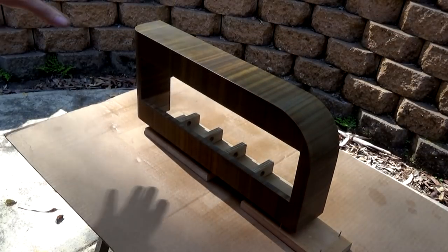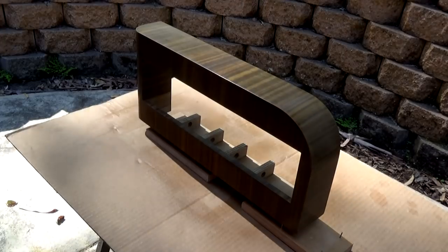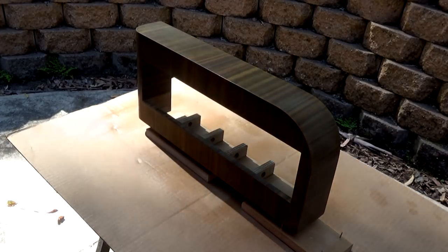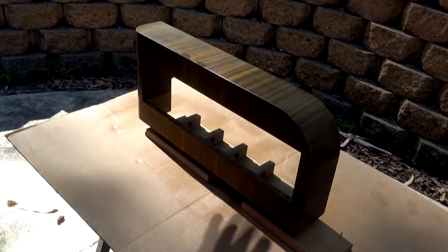So the coating I'm putting on first is a sanding sealer. It's like a heavy bodied undercoat. It dries flat and then you sand that back, and it's easier to sand. It tends to fill cracks and splits and low spots and so on. And you basically sand that back till you get a pretty flawless finish, and then you put your top coat